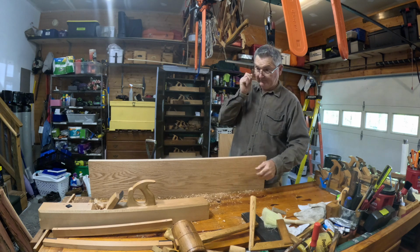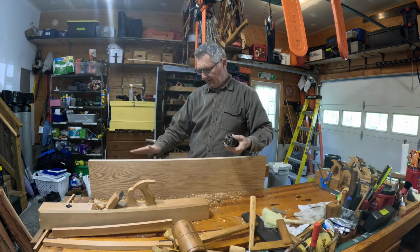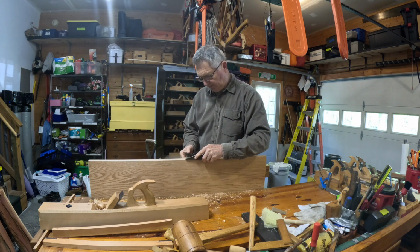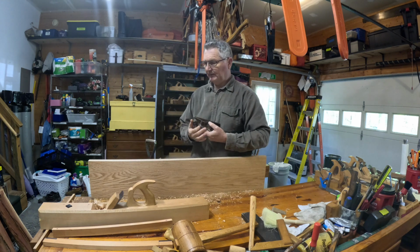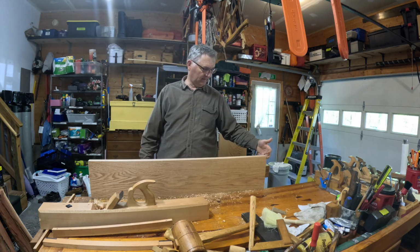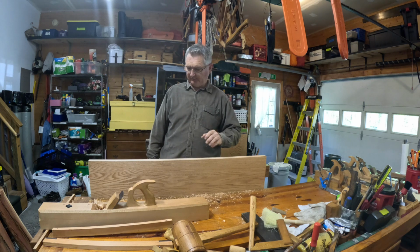And I know with these wide boards, sometimes I'll take a flashlight, look for any light between the joints. Sometimes it is a matter of just taking a little bit off here and there, tiny little shavings, to get a really good fit. Once I've got that fit, I've got dogs for the end. I'll clamp it up with straight edges, and it'll be great.